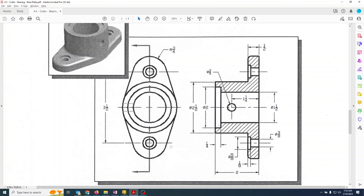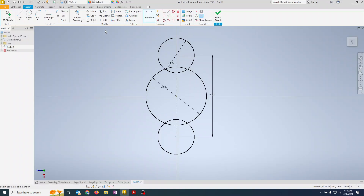That's the flat plate sketched except for the tangent lines connecting the circles. I'll click and drag to place lines without attaching them to anything, then hit the Tangent constraint and say tangent from here to here. I'll go all the way through and apply the tangent constraint to everything, since that is what we want.